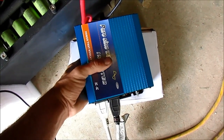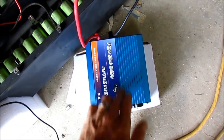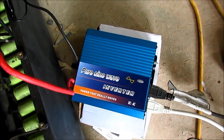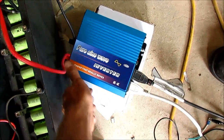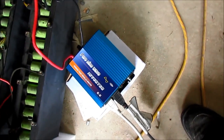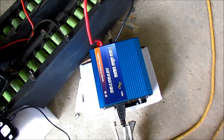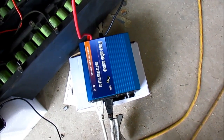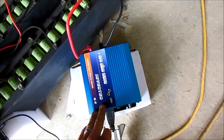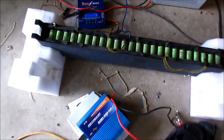I brought my IMAX B6 to help charge this dead bank because it's taking forever. It's getting up to 3.6 volts but it's still pushing its full five amps. It's actually starting to drop just because of the losses in these thin lines with the cheap IMAX B6 ripoff. Getting her up there — see how this dead cell pack does. Hopefully it can be revived. Still great sine wave out of this thing — it doesn't get warm running its full 300 watts. I highly recommend it so far. I might even put a link to where I bought this one from — it was about $89 US.